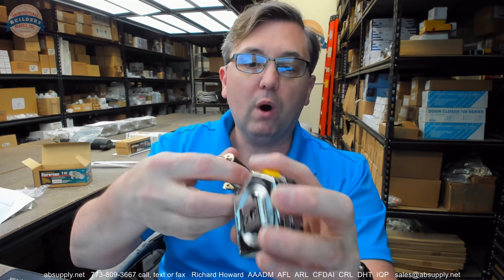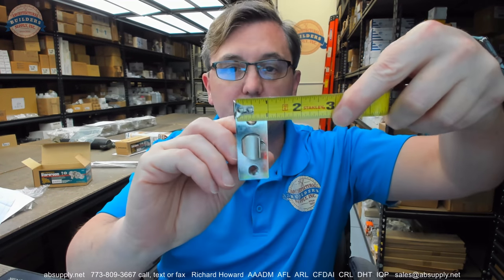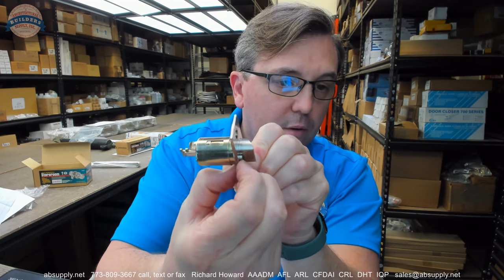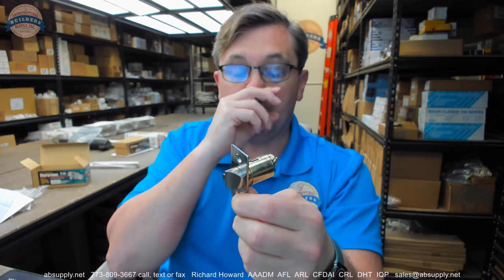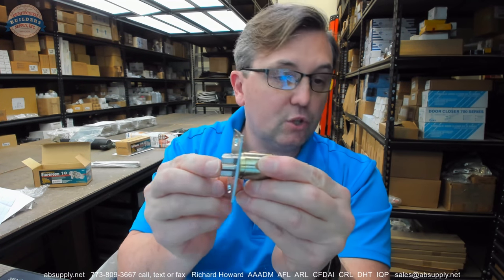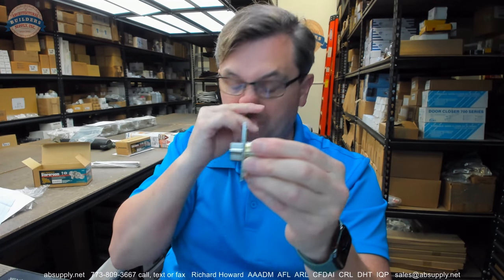This is going to be two and a quarter by one inch. Because this is a keyed lock it will have a deadlocking tab — that little tab right there. That will allow you to hold that bolt in the locked position. If the deadlocking tab was not present you would be able to defeat the latch bolt just by pushing something against it. There is something strikingly absent from the face of the latch: any indication at all that this lock is fire rated.